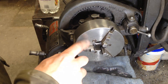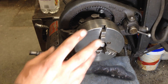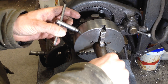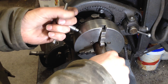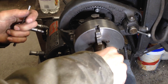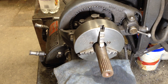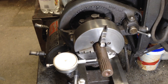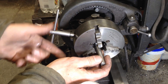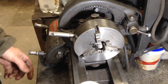I just want to test it real quick — I'll tear the chuck apart here in a little bit. I just want to see what the run-out is. That felt different when I tightened it down too. That's pretty close to true — and I just got WD-40 all over myself. That's showing 10 thousandths, so it's better. Probably should take it apart, clean it, re-grind it, take it apart and clean it again — then it might be a little more accurate.